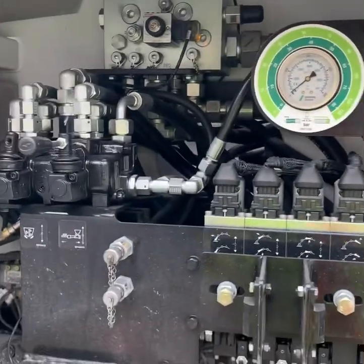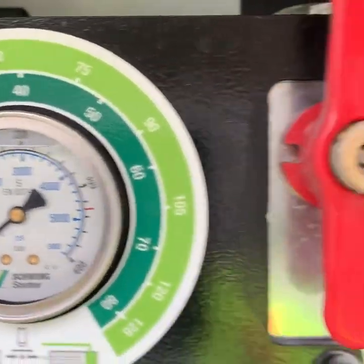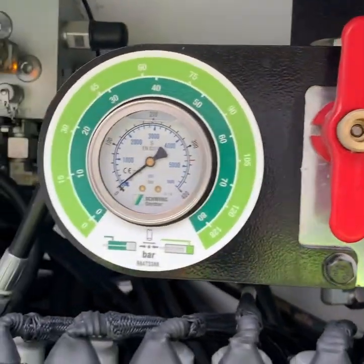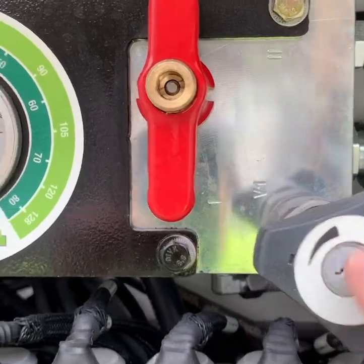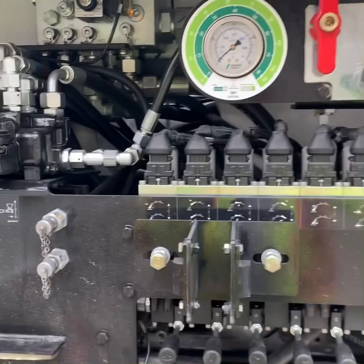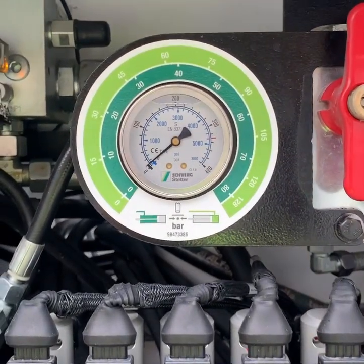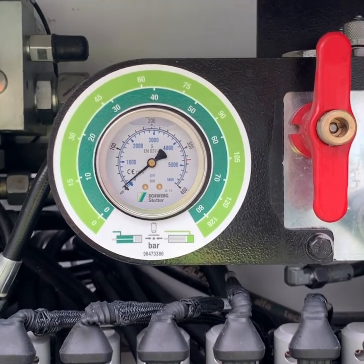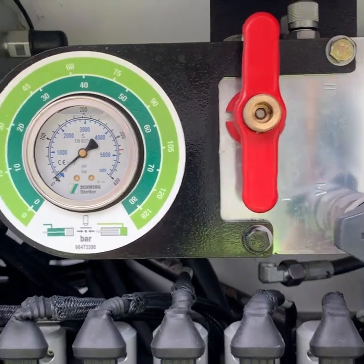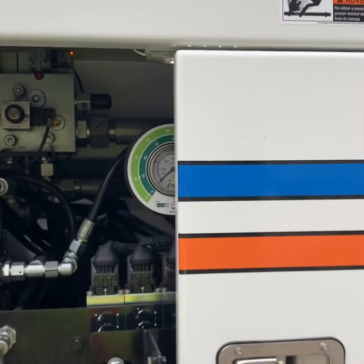Here's the aerial pressure adjustable relief valve we're talking about. We should be telling you exactly how this works but I don't quite recall — we're going over the literature again. There's a key switch so you can lock it out and save the setting. I think on piston side this pump will make about 1600 psi, so you can dial it back down to 1233 or lower when you want to do regular work pumping through the boom.